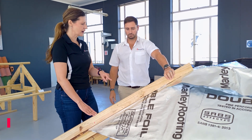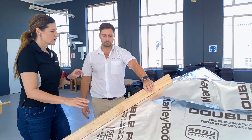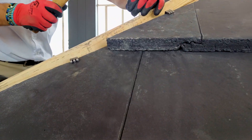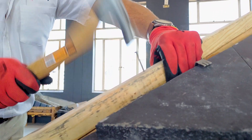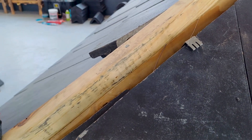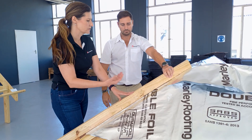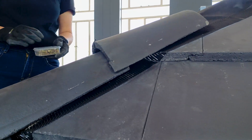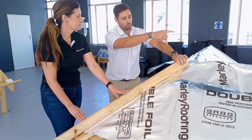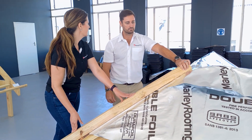Monre, I've noticed that you've come over to the hip now looking at this batten, because I thought we were going to start with the batten at the ridge. So why have you moved to this batten and what's so important about it? The reason for starting with this 38 by 76 is that we're going to use it as our double batten system for the hip as well, for the dry ridge. What you normally use is the ridge tree, but because we're using it on a hip here, the 76 by 38 is basically giving you that double batten equivalent of 38 by 38. The purpose is to make sure that your ridge tile rests nicely on top of the rest of your tiles — that is correct — and it gives you one straight line. We're also starting here because we want to measure out all the battens, since they'll be fixed against this one.